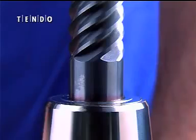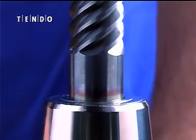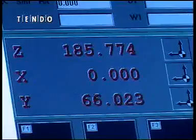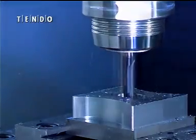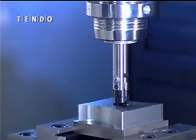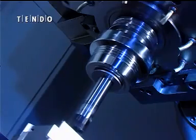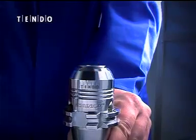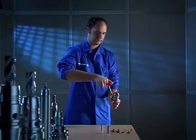The benefit of the radial pre-adjustment is quick compensation from the side of the tool holder for differing tool lengths. Quick and easy setup equals lower setup costs. Intermediate sleeves can provide even further flexibility to Tendo — one tool holder can be used to clamp several cutting tool diameters. These sleeves are available for both external coolant or through-the-tool coolant. Insert the sleeve, insert the tool, turn the actuation screw to its hard stop. Ready to use.